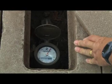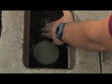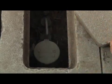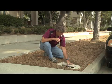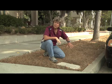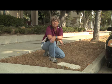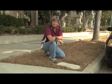And for those type of repairs, you should call in a professional to help you find exactly where that leak is. If you're not going to be home during the day until the plumber can get there, you can shut the water off right at the valve, and that'll stop the water from leaking. Now that we're done, you want to make sure we close up the box, close the lid to the meter, and if you have any shrubbery or anything that's blocking, your meter reader would really appreciate it if you'd prune that back a little bit.